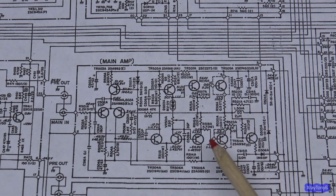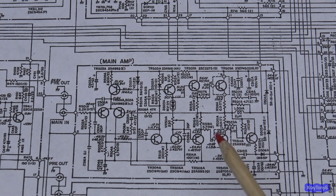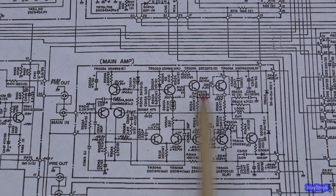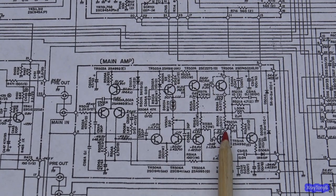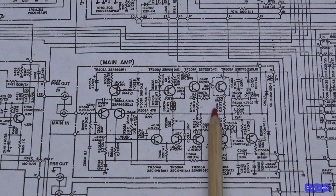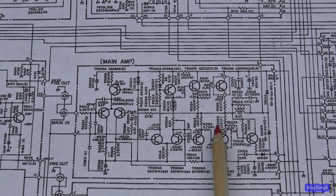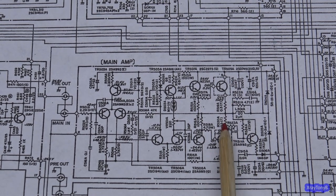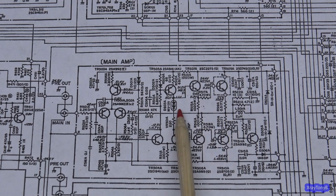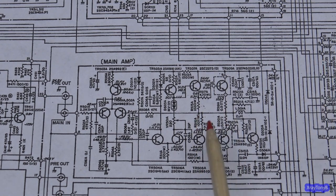The idea is, you never want one transistor to shut off before the other one fully turns on. And that's what this bias spreader is all about. It makes them both turn on enough that you have a nice crossover area where both transistors will be on for a little while before this one lets go and this one takes it all. If these are well matched and these resistors are perfectly matched and everything else, then you could turn that way down to a lot less than that and it'll still work and the amp will idle much cooler. But you have to know what you're doing.